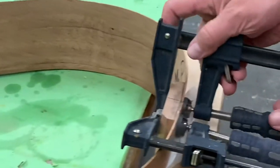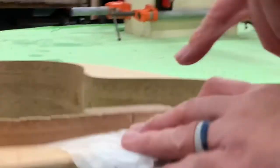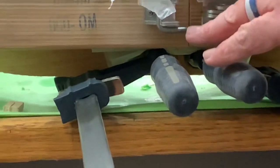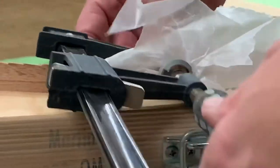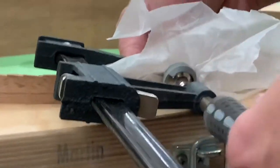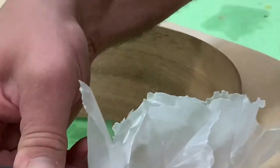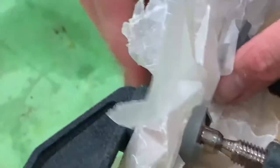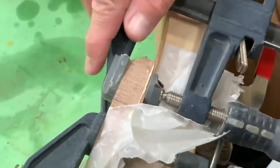I'm going to take these and lay them down, because my next step is flipping this whole thing over. Now it'll lay on those clamps because I laid them down, and I'll push that down. We don't have much room up here, so this might be a case where I take the clamp and clamp it to the frame. You know you have a good glue joint if you look inside and see some squeeze out.